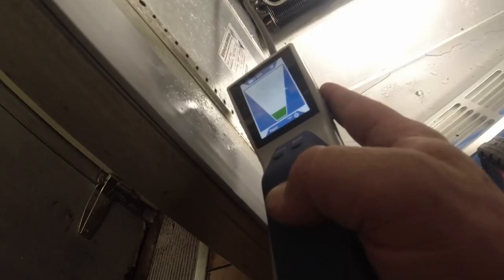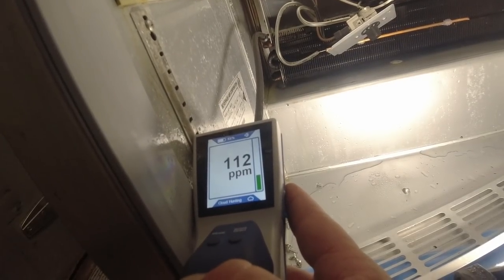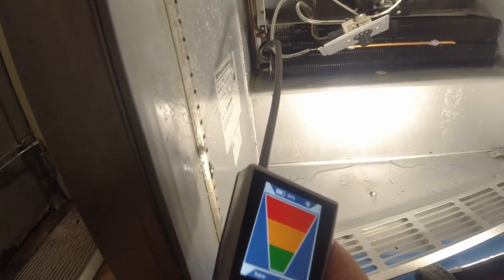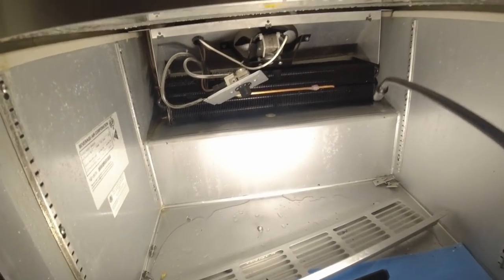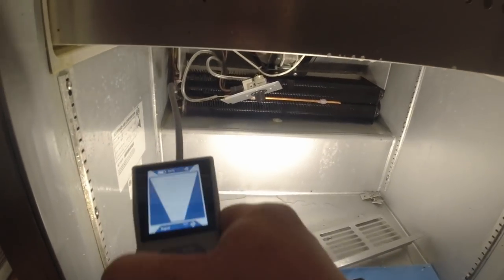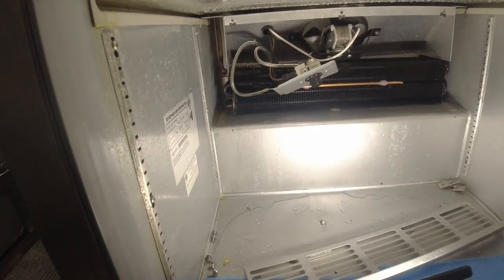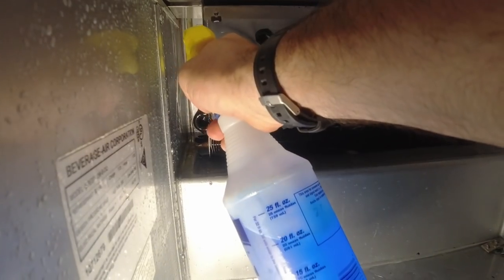Looks like we've got a couple of different leaks. Some of you might say you could tear that out and solder it, and I probably could — but if it's eaten through the solder joint, who's to say it hasn't eaten through the copper somewhere else? We're just going to quote them to replace it. I'll recharge it for now. This is why everything is failing — they made the copper thinner for efficiency and proper heat transfer to save energy, but now the coils don't last. This throwaway society is coming back to bite us.